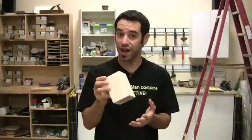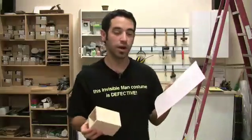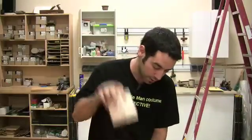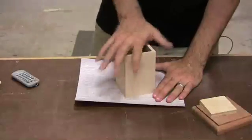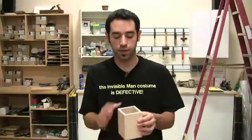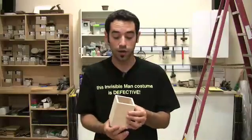If it's not, the easiest thing to do, get yourself a full sheet of, I'd say about 100 or 120 grit sandpaper, lay that down on a flat surface, something that you know is flat, and then put this down right on the surface and push down and twist. Think of opening a can of tomato sauce. And after a few twists, you should be left with something that is relatively flat and will increase the strength of our glue bond.